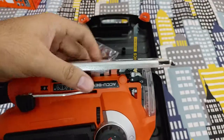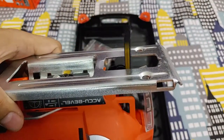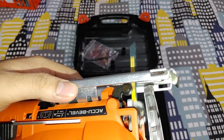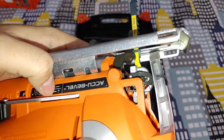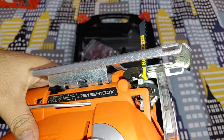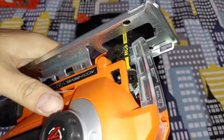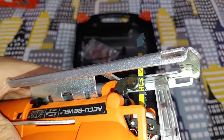Let's check out the pendulum motion. The swinging motion will be much more prominent when you're actually cutting through a material. While cutting through a thick piece of wood, cardboard, or metal it makes a backward and forward jerky motion — you can see that metal lever moving — making it easier and faster to cut through compared to a regular jigsaw.